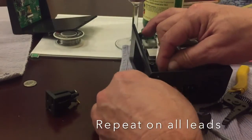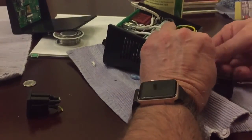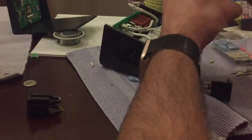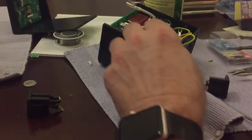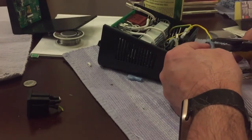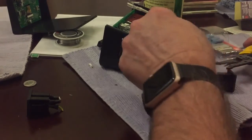I had to re-crimp one lead on there, so that's what I'm doing now. The connector's going to stay on a little bit better. That ground wire was giving me a pain. I might want to go down to the smaller female disconnect. But in the end, I was able to clamp it on pretty well, so it's not going to come off. I triple checked this. You do want a ground wire — you don't want a component that's not grounded that's susceptible to water or moisture. I eventually did get it to stay on and tested it — it was fine.